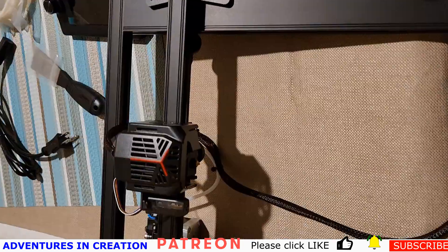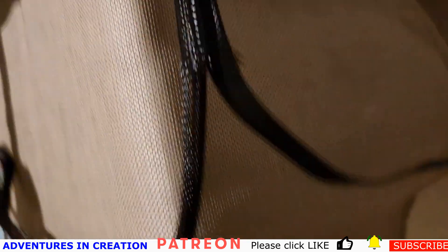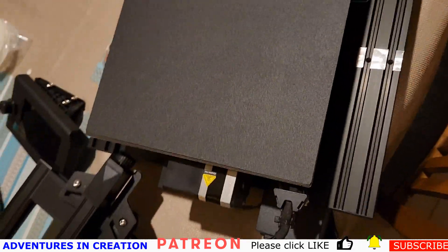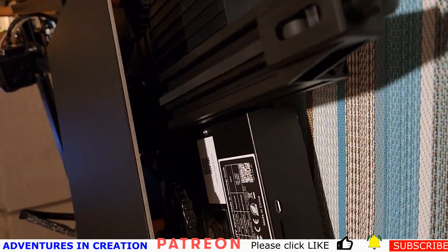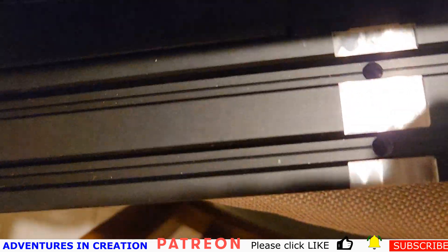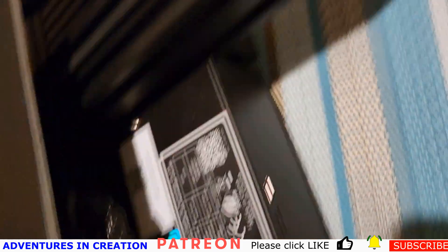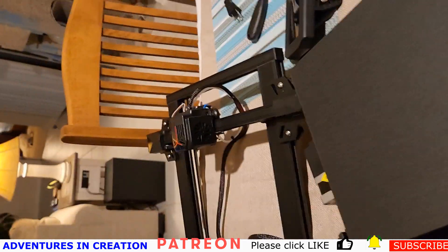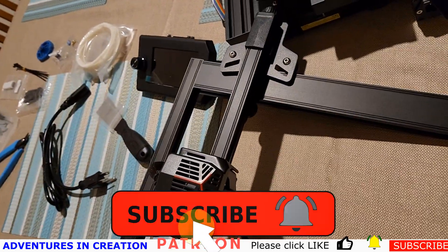It comes in two parts basically, with all these little extras. That little guy there goes on top of the extruder so you can see it moving. You can see it's two pieces — that gantry fits on top of the main bed. The assembly is pretty much just standing it up into those cleaned-up areas. There are screws underneath; you take those allen bolts, put them through those holes, two on each side, put the gantry on top and screw in those screws.